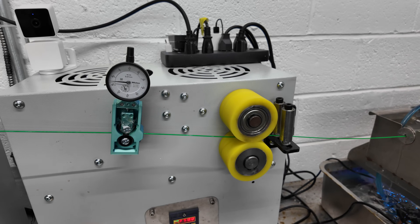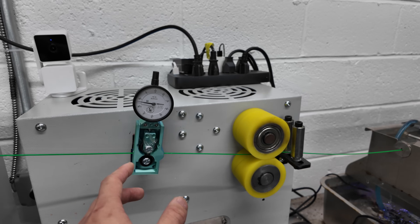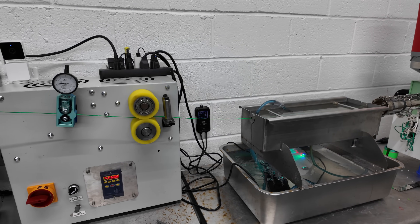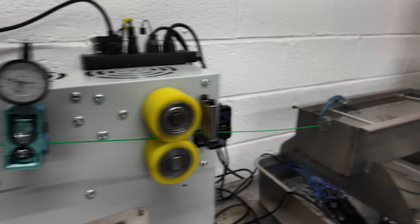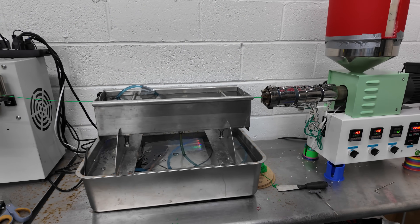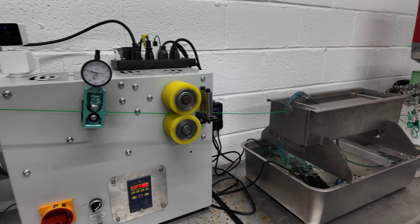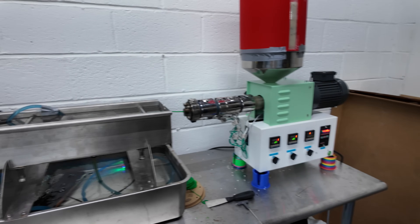The only other upgrade would be to upgrade this dial meter to a laser measuring system, where a laser measures the diameter instead of this dial meter. Those do cost about a thousand dollars, so I don't know if that's worth investing in at this stage of the business. Hope you guys found this video useful — let me know if you have any questions. This system right now, as it's running, will produce close to one kilogram every 35 minutes with the speeds and temperatures we have set up, and that's where we're happy with it.